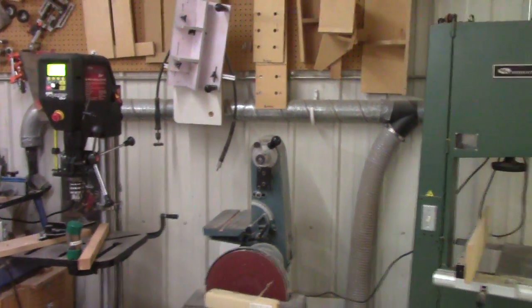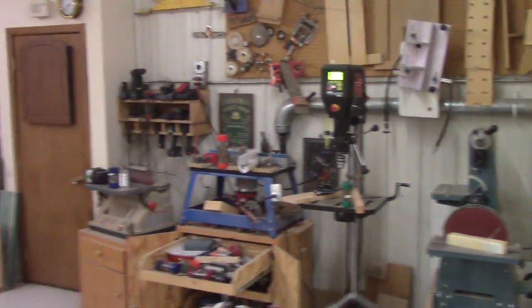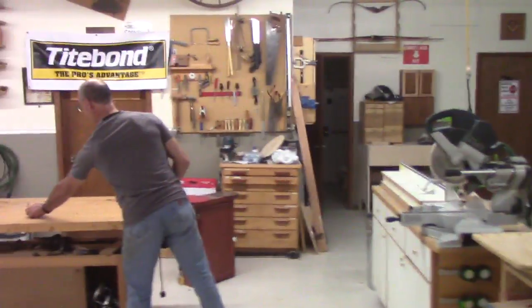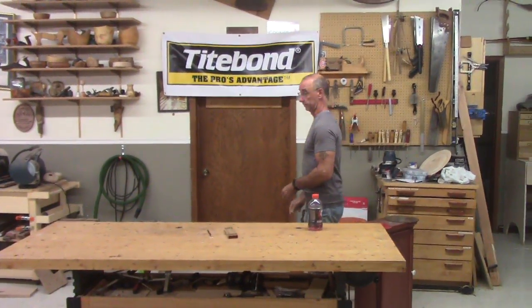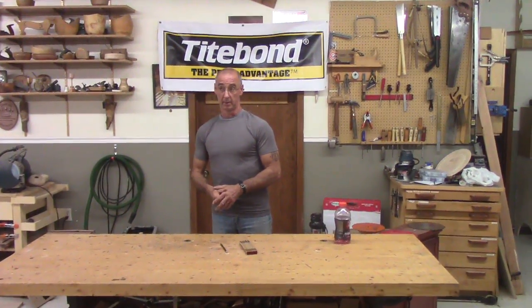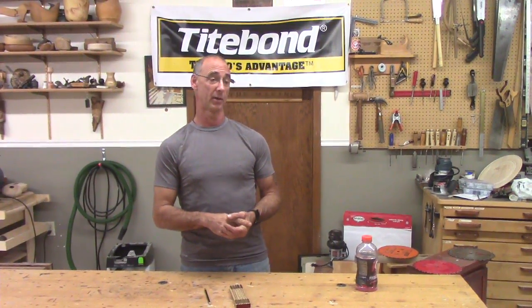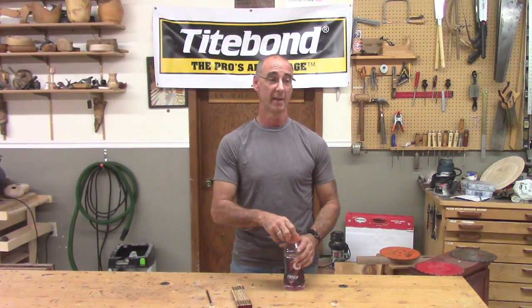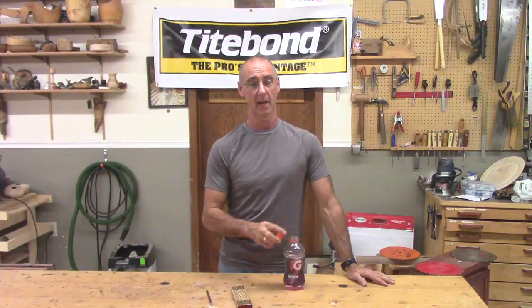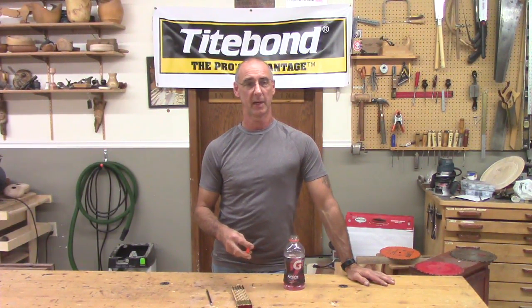Thank you. Tom says, I need to paint the inside of a bathroom cabinet made out of particle board that has previously gotten wet. What grade sandpaper should I start with and end with to ensure a decent finish with water-based semi-gloss paint? Start with, I don't know, because I don't know how bad it is. So start as aggressively as you need to not make it take 14 years to sand. You probably got to sand it up to a 180 or a 220 or so in order to get it to level out.